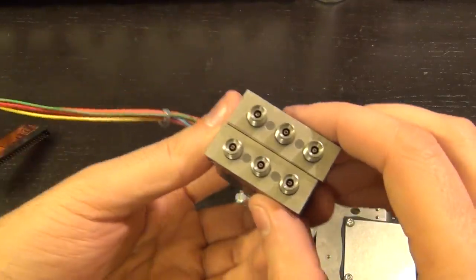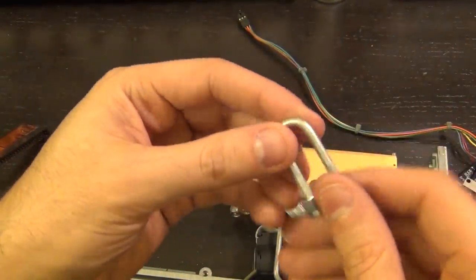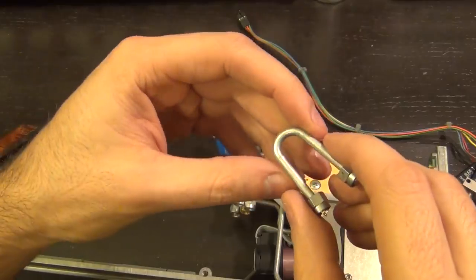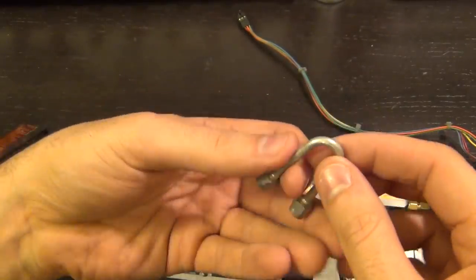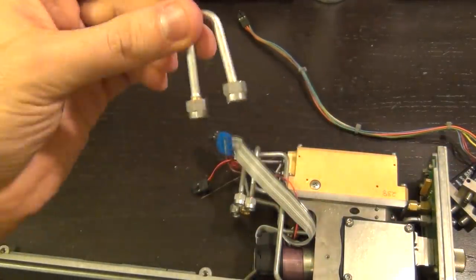The microwave switches with K-compatible connectors came off nicely. These rigid cables are quite rigid, which is actually great — when they're this rigid they're extremely stable in both phase and amplitude, making them excellent phase-stable cables for S-parameter measurements, but only if you keep them in this shape.